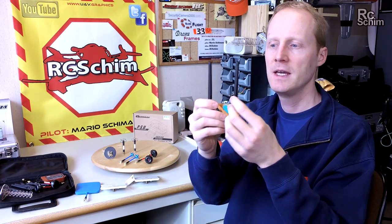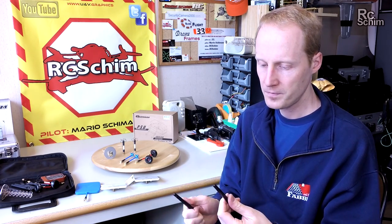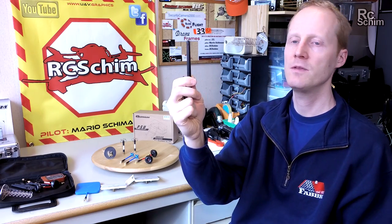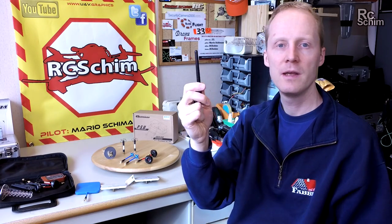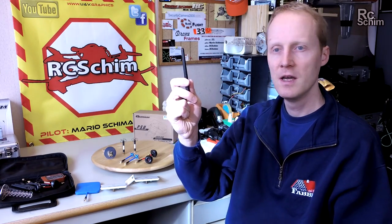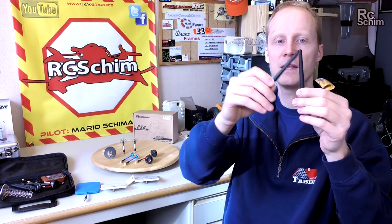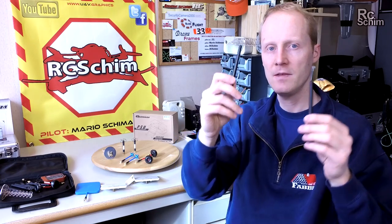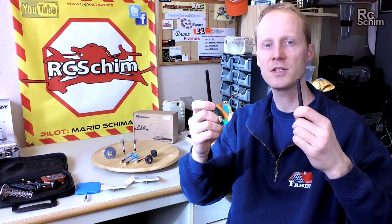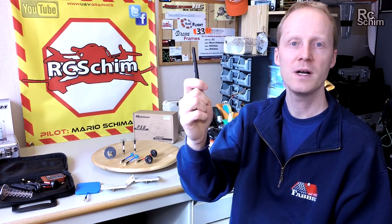Don't forget these standard antennas — they are bad in so many ways, which is why you don't normally see them in use. They are omnidirectional, so you can imagine a donut placed around this antenna, but the signal is not circularly polarized. That means straight radio waves go out from the sender and into the receiver, but if the antennas don't match direction anymore you don't get a good overlapping signal. And with multi-pathing, reflections caught by such an antenna produce totally unpredictable results — sometimes the reflections give you super good quality and sometimes they cancel each other out, effectively killing your signal.